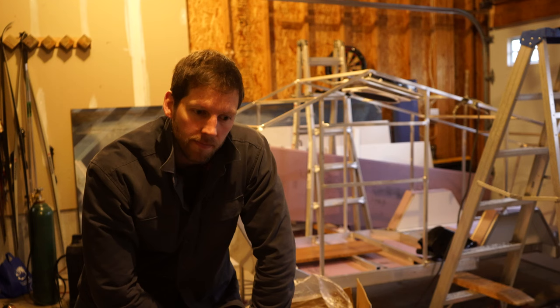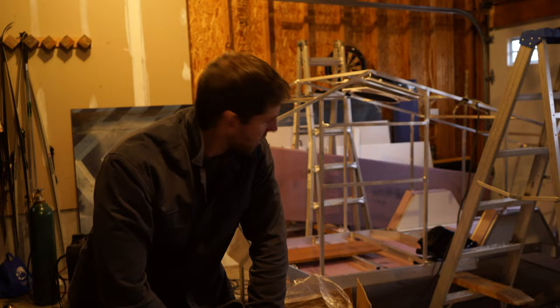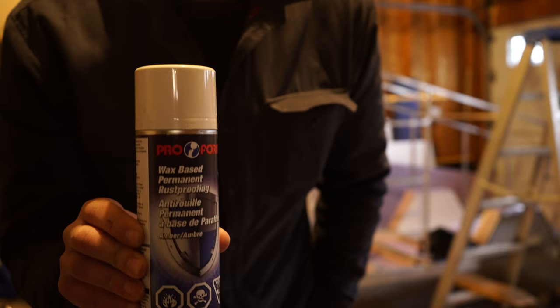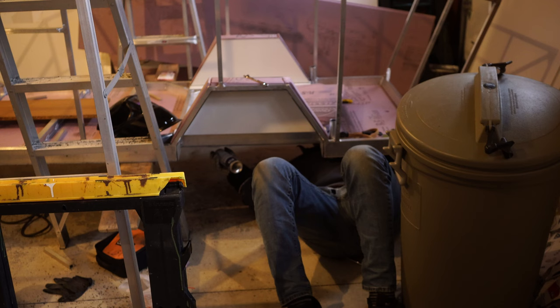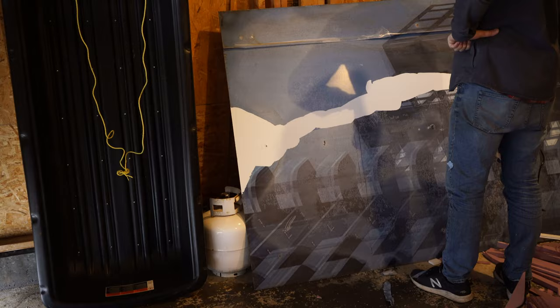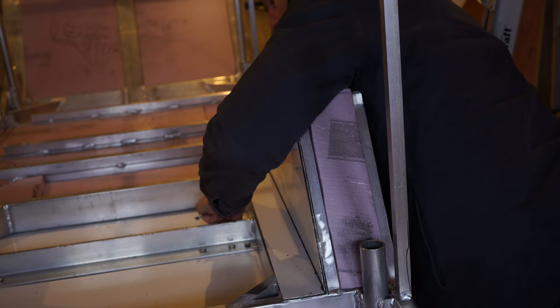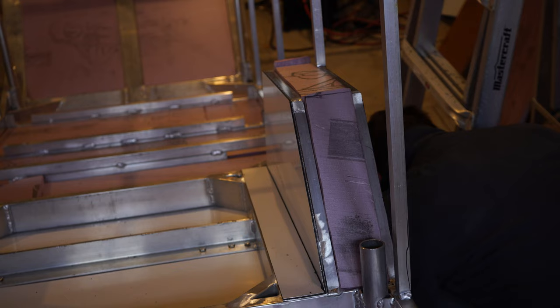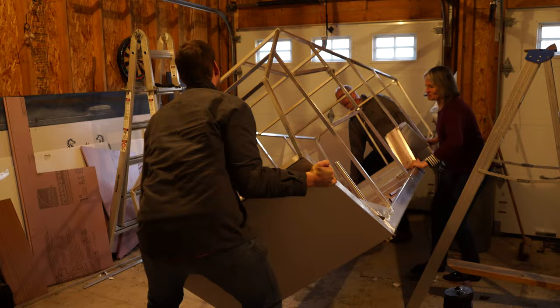I'll have to build a frame inside to mount the trim cover on the inside, but it should be pretty good. I'm going to try to prevent any corrosion between the aluminum and the steel of the torsion axle. Back to peeling off the old sign — who knows what this was, maybe a sign for a funeral house or something. Tightening all the bolts and nuts on the torsion axles one last time before I start to put the side panels on. I can't reach them anymore after. And then, with the parents' help, we twist this sucker onto its side to put on that first side panel.